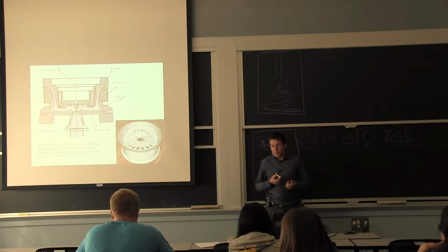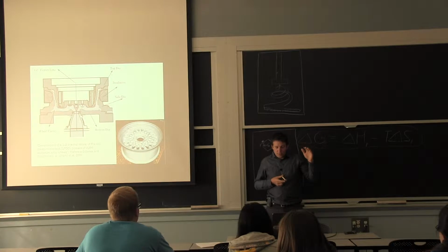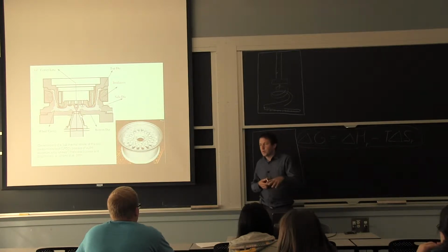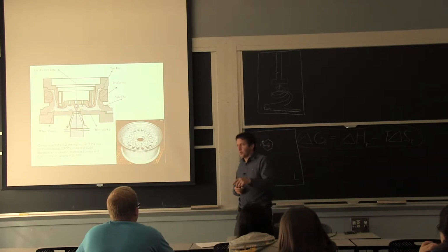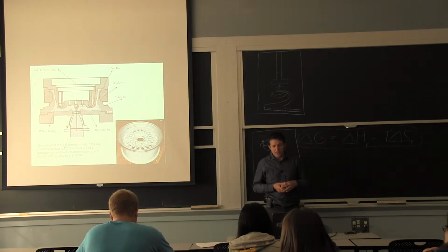First of all, you don't have to heat your metal as much, so in terms of oxidation, it's less of an issue. But also, if you reduce your melting point, your heat transfer is not as chaotic with the mold. So the lowest temperature you can get for casting, the better it is. There's no doubt about that.